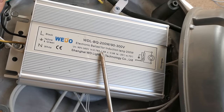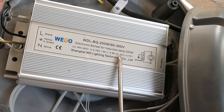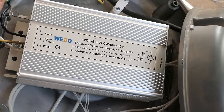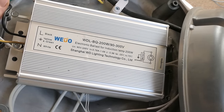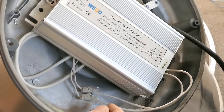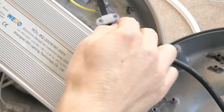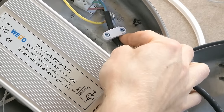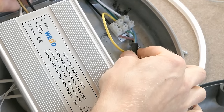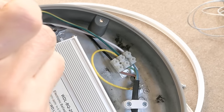The nominal voltage of mains, the input current — of course if it's regulated, the higher the voltage the lower the current. It should have a very good power factor. The mains comes in here: live, neutral, grounded. It seems to have just two wires going to the inductors, and there is a terminal block connecting the coils in parallel. The cable from outside enters a terminal block with a strain relief, and the ground goes into the power supply itself.